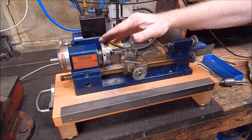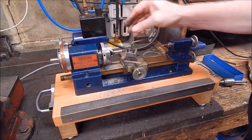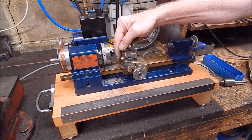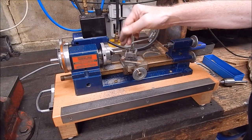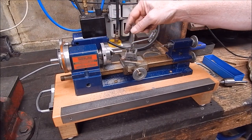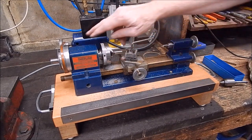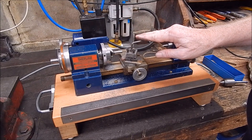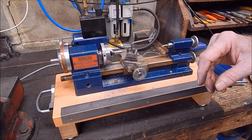The little lathe has worked great. I never thought you'd be able to use carbide on a Sherline. Amazing. The finish isn't too bad. You've got to keep the radius pretty tight on these, otherwise you get chatter, but that's not bad. And you can always finish with high speed steel anyway. It was spinning at 2000 RPM, the maximum in low range. You can see I've squared the motor up. I just put a little spacer plate in there. That solved that problem. The thing's running like a charm. It's amazing.